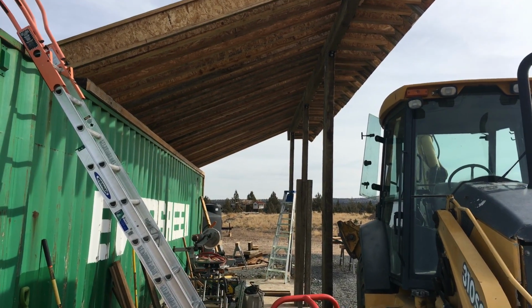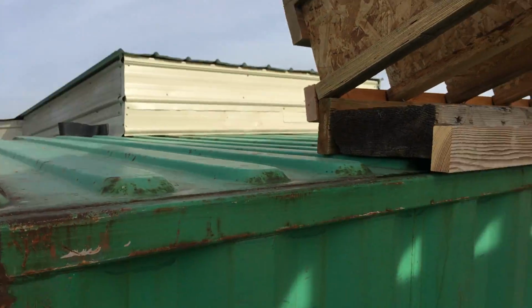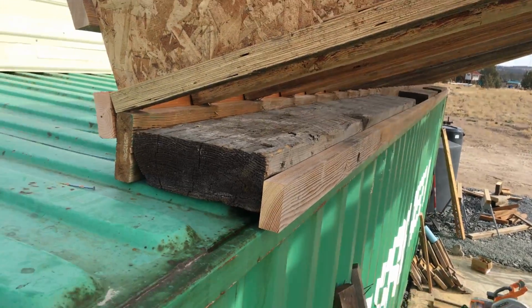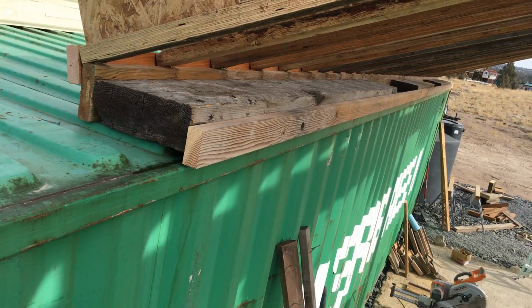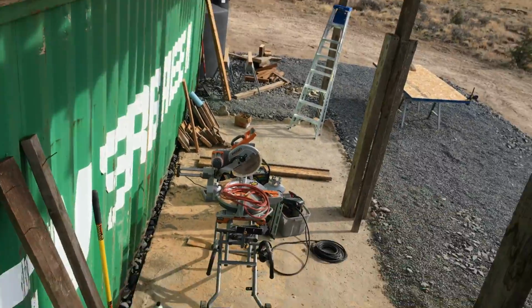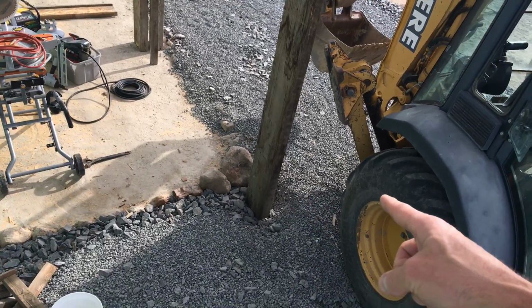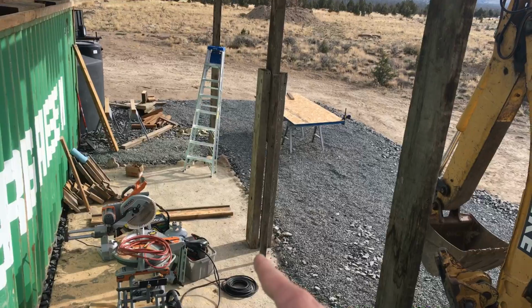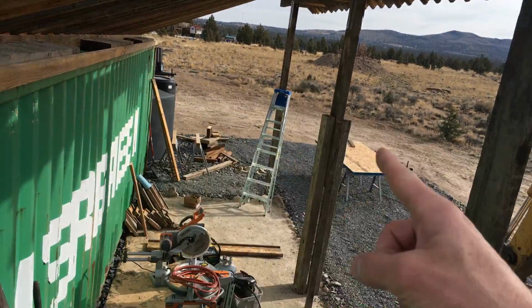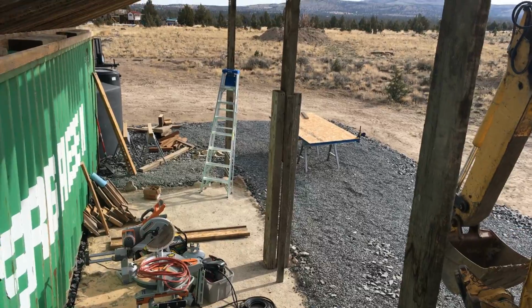but it is so strong already. I've got hundreds of pounds of beam up here, right? And then I'll come in and put a few metal tabs in and weld down, and that is never going to move. These things don't want to move because they're 4x12s. Especially this composite one over here, for the physics, for it to get up over itself to tip one way or the other, it has to lift all this weight up and get over the geometry of that while fighting all that.